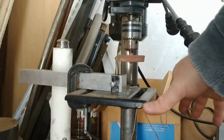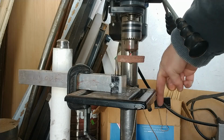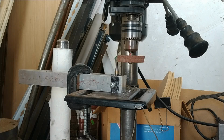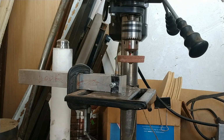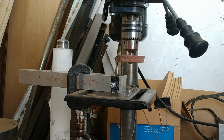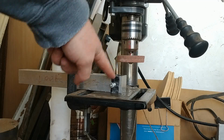There's a potential of flex, and there's a potential for the headstock or the shaft that the knee runs up and down on to be curved like a macaroni noodle. But we're trying to get the best we can out of flimsy and cheap equipment that everybody might have. All of this stuff would be easy on a milling machine, but this project is about what you can do with home grade stuff.